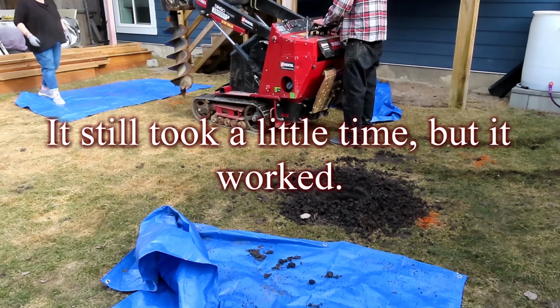To give it extra protection, I bent some extra wide flashing. This will bring the water farther away from the house before dropping onto the aluminum sheets. Push this extra flashing against the wall under the existing flashing and nail it on. As you can see, if you pour water on the panel, it will flow to the bottom.